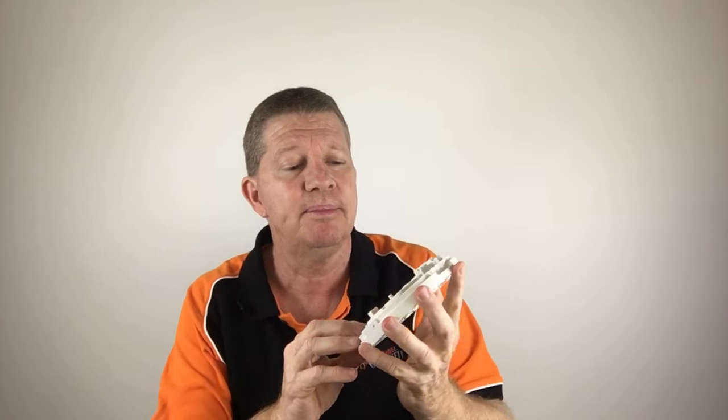And the relay base is very similar to this one, and what it does is basically utilise some contacts in there to do things when the alarm goes off. That's the whole point. Many people think, what if I can't hear it, or what if they're hearing impaired, any number of things that they want to occur when the alarm goes off. You can use a relay base to switch things when the alarm senses smoke. The most obvious one would be to turn on lights, and that's why I had to use it this week. It was a long corridor with alarms in there, but the people in there aren't always familiar with the area, so we wanted little downlights to come on when the alarm went off, to give them a direction to the exit.